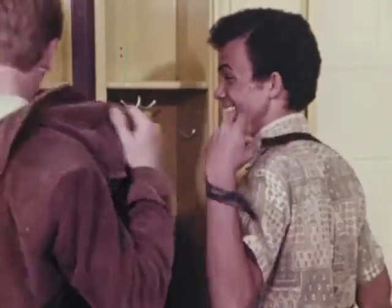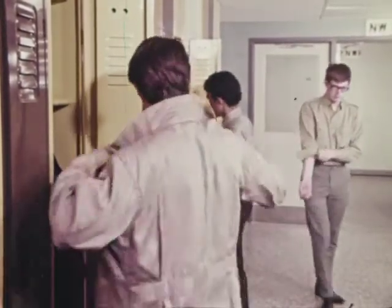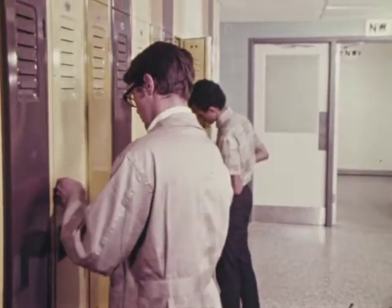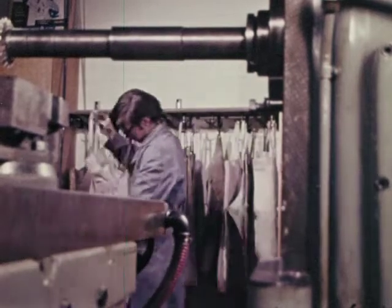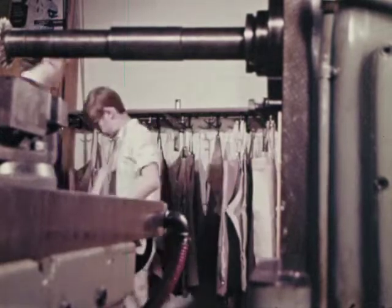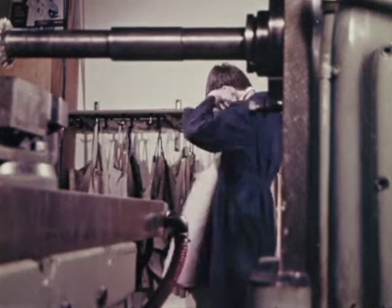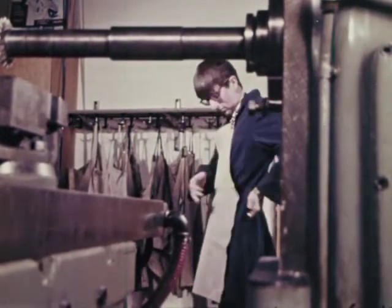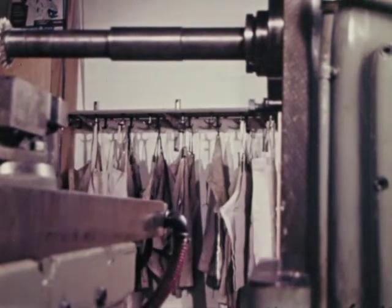Take off your tie. And take off your rings and wrist watch before you start to work. Shirt sleeves are bound to get in your way. If you wear a smock, button it up. Loose sleeves are rolled up above your elbow. If you don't wear a smock, wear an apron. And don't forget, when you work with a torch or any flame, you will need extra protection. Put on a leather or asbestos apron to protect against the heat and shield your clothing against flying sparks.